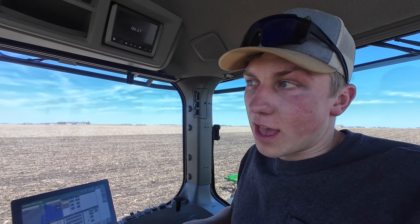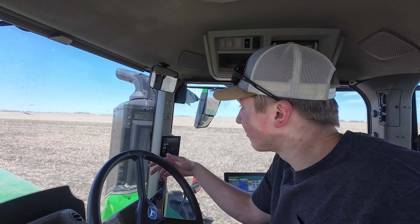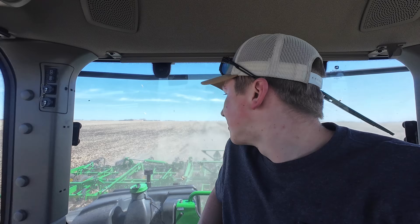This field particularly has a lot of cornstalk residue from the previous year's corn. There was a little dust devil that just blew through — and that brings up the point: there's a lot of residue in this field. A lot of cornstalk residue because we didn't have much snow this winter, and we didn't have a lot of moisture, so much of that stuff didn't decompose like it usually does. We're trying to bury some of that with the digger. If you get too much cornstalk residue built up under the digger, it can actually plug it — and it just basically moves a huge pile of residue the whole time the digger moves.